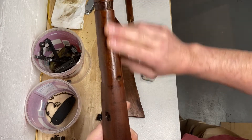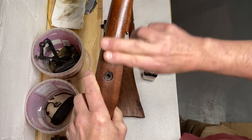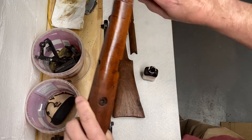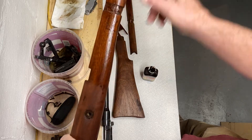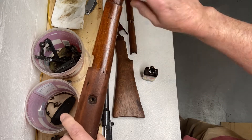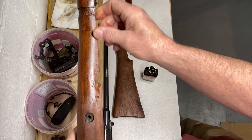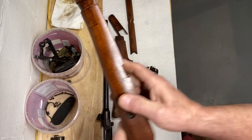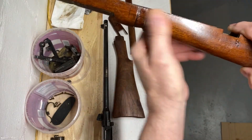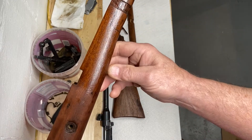When I set these up to dry, I found that keeping them in a cool place takes a little longer to set up, but the longer it takes the more the oil sinks in and flows out. You almost want to put it on so you can just barely touch it — push that oil in because you don't want any runs. Get it nice into the grain. I really work it into the wood — don't just lay it on there, you've got to push that oil in to get a nice finish.